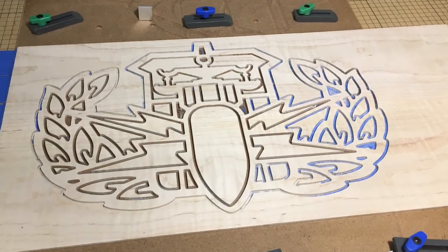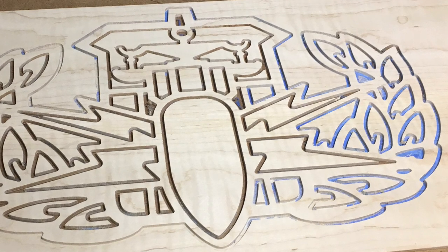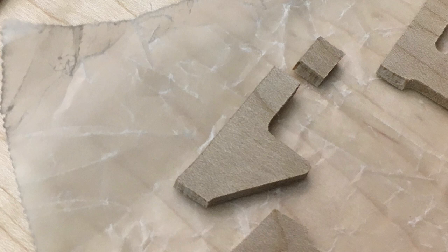This is a picture of the final inlay after I routed it. I used the glue tape method of attaching it down to the waste board because it had a lot of parts that could fly out and I didn't want a bunch of tabs. The downside, as you can see in the very next picture, is that I broke it while I was removing it. I didn't realize the significance until I went to put it in and found a part missing — I had to dig through the trash. Fortunately I was able to find the part, put it in, and attach it without any problems.